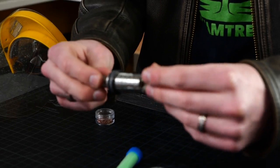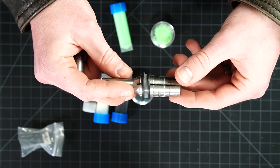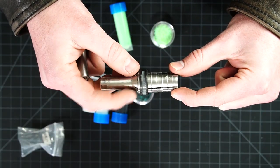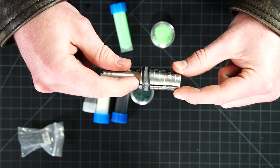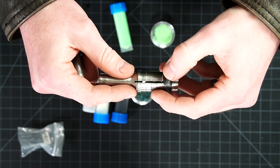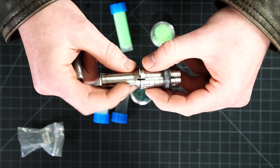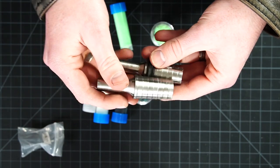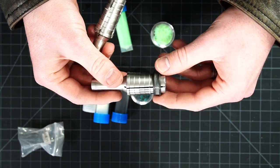So the little splines, there's four splines on each mandrel. They come out a lot further on the end than they do here because the pivot point starts here. So it kind of bends like that. So it's kind of challenging to use the final steps, and it's also a little bit more challenging to get it perfectly centered. So that's why we designed them to overlap.